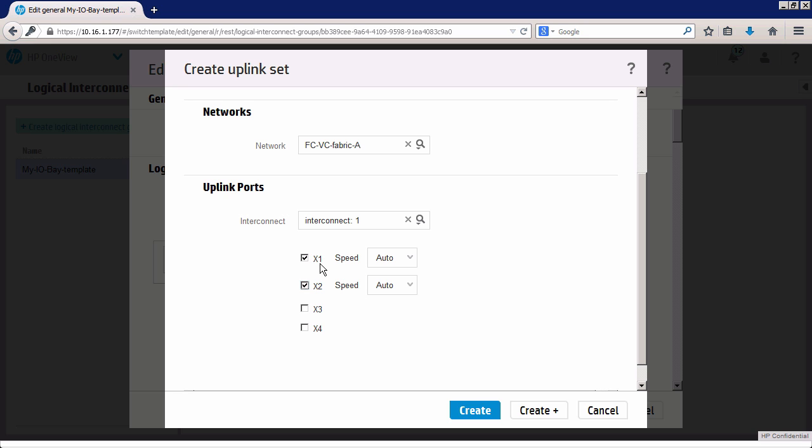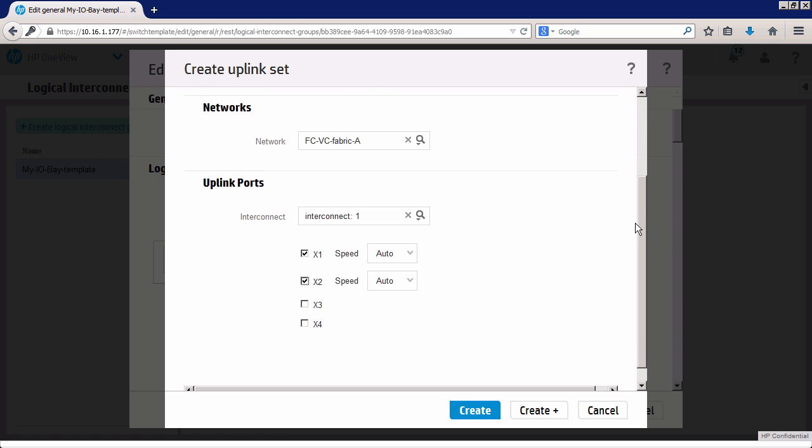If you have multiple cables, the way Virtual Connect works is Fibre Channel NPIV mode. So we can talk with an MDS or Brocade, either or. We are not really doing any kind of E-port trunking or ISL link. We're just doing the basic NPIV login. If you have multiple blades, the blades will do the round robin. The first blade will log in from this port, the second blade will log into this port. So this is the first one.